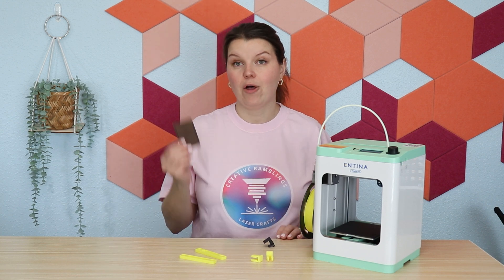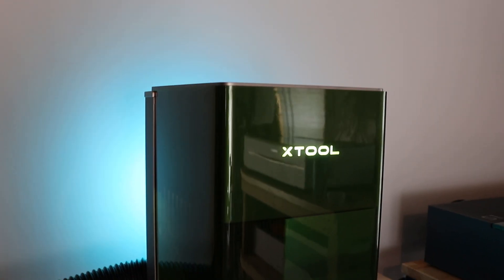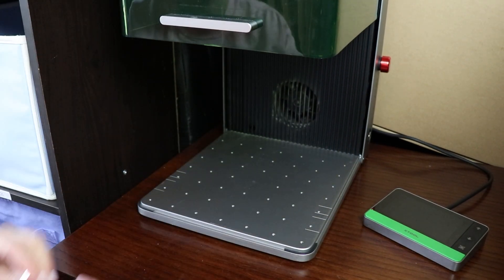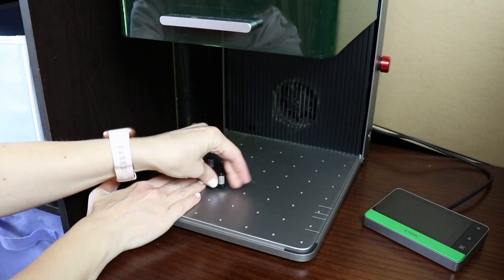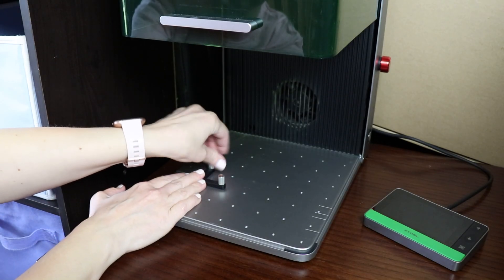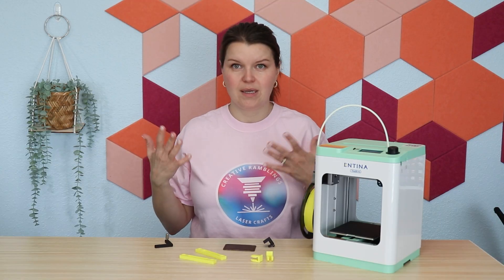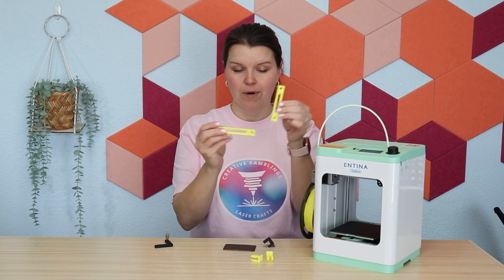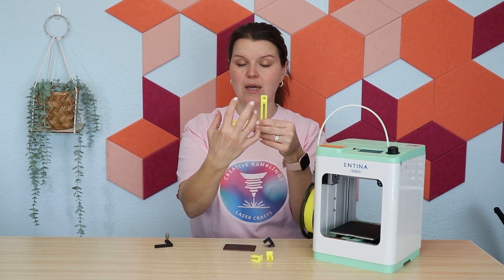So I knew I wanted to create, with my 3D printer, a different type of clip that would help hold these down. The second thing I wanted to create was a jig for my F1 Ultra. This is a Galvo-style laser that has a diode and a fiber in it. The base of the F1 Ultra has a bunch of holes, and when you get it, it comes with one bracket and two little pins that kind of screw in and hold your item together. But you're kind of limited on where you can place that little bracket, so I wanted to print something more adjustable. I had seen other laser users use 3D-printed jig items, so I found and printed these. When used together, these can slide up and down and back and forth, so I could put a metal business card or a coaster in here, frame it up, focus it, and as soon as I'm done with that coaster, take it out and put the next one in without having to reframe or refocus.